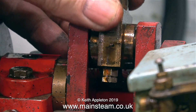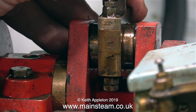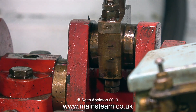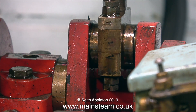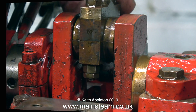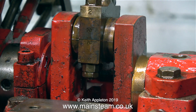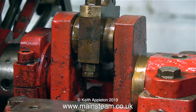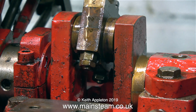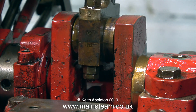The output from this pump cylinder is connected to a pipe which supplies oil to the substantial main bearing in the centre of the engine. I would assume there is a drilling in the centre of the crankshaft that allows some oil to get to the crank pin, which in turn lubricates the big end. So the lubrication must have been very good at this side. When I spin the engine round to look at big end number two, I really don't know why this one is so worn — just look at it, it's a rattle fit.